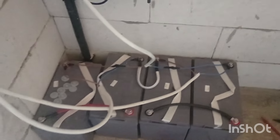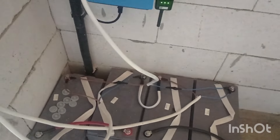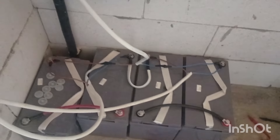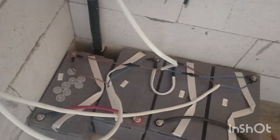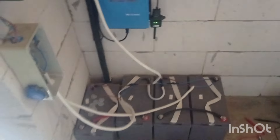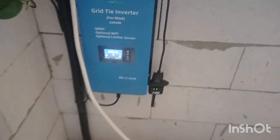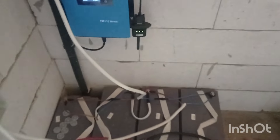I've actually ordered a balancing device — it's 33 bucks from AliExpress and will take about a month to arrive. It will balance each of the 12-volt banks to match the voltage. Currently the balancing is only passive because current flows across these connections, but I don't care much since I don't have huge consumption here — I only need to gather about one kilowatt instantly.